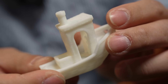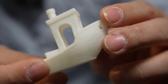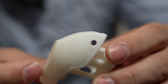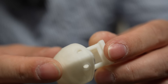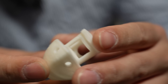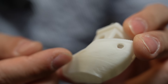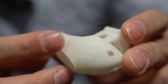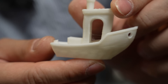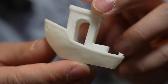Overall this is extremely passable print quality, and even if we slowed it down a minute that would give it a lot more time to produce a quality product. This is remarkably good for how fast that was. Even the edges here — they're not rounded over at all. The input shaper didn't have to be very aggressive with smoothing out these external perimeters, and that just comes down to how light the tool head is and how much motor power they have driving it.